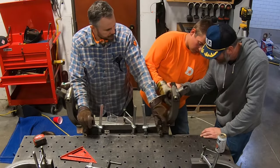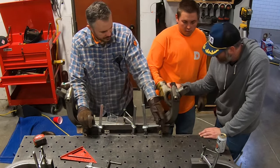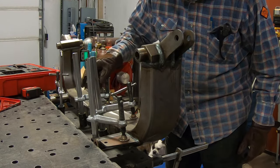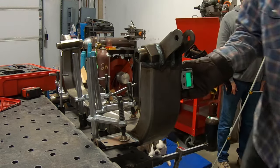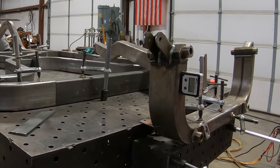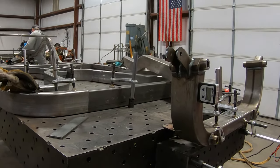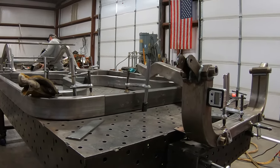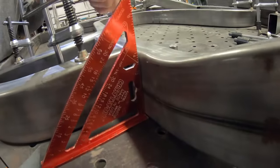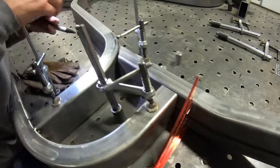Like the rest of the frame, it's a bent piece of 4x2. It locates the upper and lower suspension pickup points, as well as the mounts for the sway bar and steering rack, and all to the custom dimensions I specified. It's the first of several pieces from those folks who make legit race car gear in an affordable and very streetable package. So, I'm going to scoot this clamp over to see if the tube straightens up.